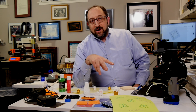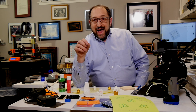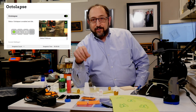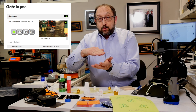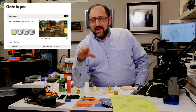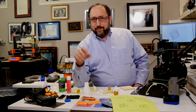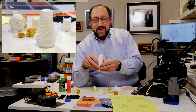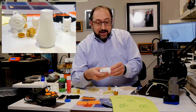Back to Google, checking on the firmware and everything I could find. I came across the fact that if you use the Octolapse plugin for Octoprint — and I print everything through Octoprint — it can cause problems in vase mode if not set up perfectly. Octolapse is that wonderful software used for time-lapses where you just see the print growing with no printhead visible. So I uninstalled Octolapse. I now realize it injects G-code into your print stream, which isn't something I want if I'm looking for quality first. I uninstalled it, and the next thing I printed was a vase that came out perfect — no underextrusion at all, at least as good as I normally get on a brass nozzle.